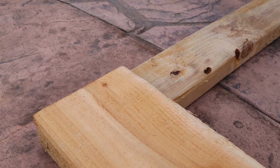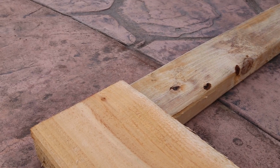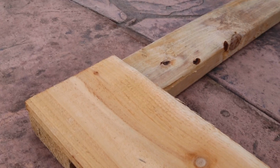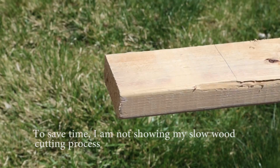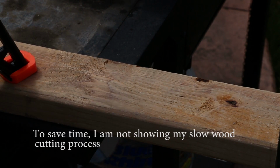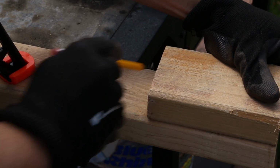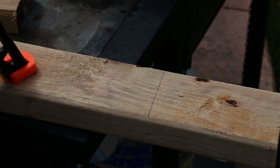And what I'll do here is cut the 2x4. You can use scrap wood from the scrap bin at the local hardware store, or any piece of wood that you have to join the 2 picket fences. You can use a handsaw to cut this, or a circular electric saw. Since you already have one piece cut, you can use this as a template to do the rest. And that's going to be the next cut.